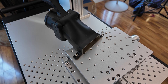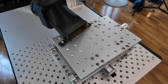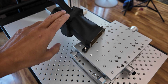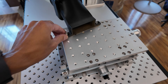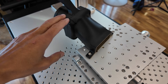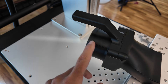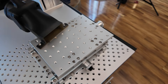Fume extraction is pretty important when it comes to fiber lasers. It really doesn't matter what you're engraving — you really want to get those particles away from you and out into a different location. Here you can see a nozzle that I printed. It's very handy because it's got these little mounting points. I'll put a link in the description to that, and I'll also put the adapter I'm going to be using because I need to go from this size here, which is about 3 inches, up to 6 inches for this AC Infinity fan.